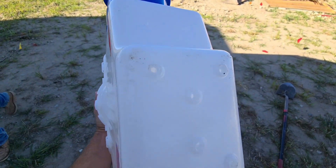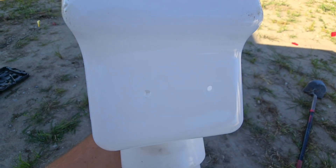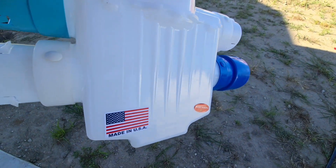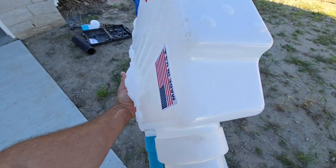The guys did a great job — they drilled holes in the bottom and also drilled some extra holes. You can see there are some extra holes right there. In case the bottom is full of sediment, you still want water that's left in the catch basin after rain to be able to leach away.